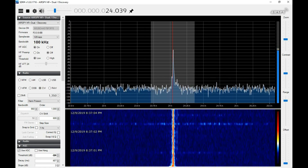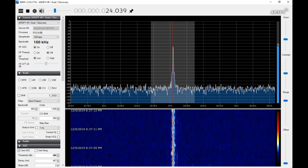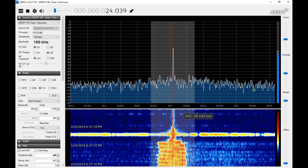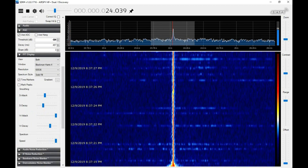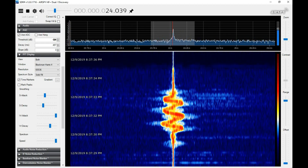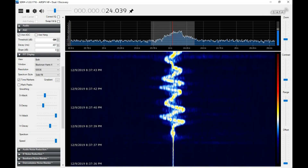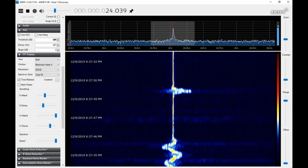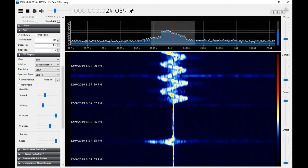Not anything all that exciting, but something else that you can do with your SDR receiver that maybe you hadn't thought of in the past. A couple more little Doppler shifts here. Let me try something — let's move this up a little bit, maybe even speed this up. And I'll turn the gain down a little bit, adjust the contrast to make it a little bit easier. That's simply moving it from left to right — this is towards the transmitter. You can see it go way up in frequency — about 500 hertz — and down and back about another 500 hertz.